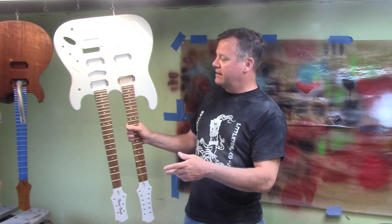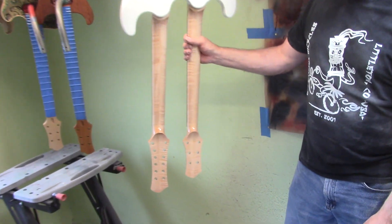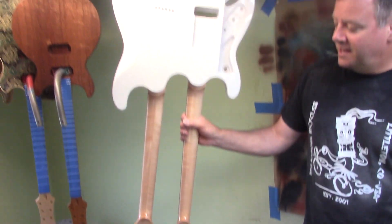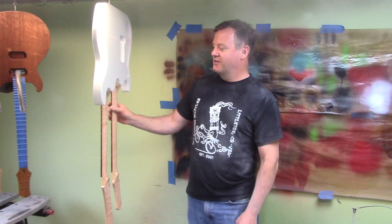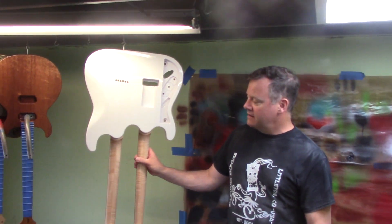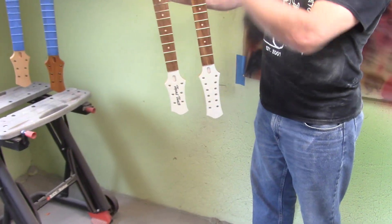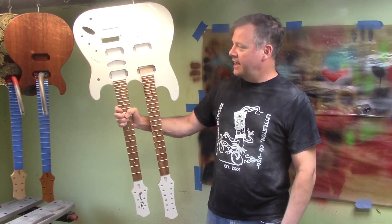Yesterday I came out, and after masking off the necks — because we left the necks natural, they've got all sorts of flame and they're super sexy. Jim said he really liked the necks and was glad that we didn't paint white over them. Masking the necks was a little difficult but it looks really good. Then I laid down the base of the white, did two coats of that — it's the whitest white we could find — then painted the headstocks, put the logo on, stripped off all the masking, and shot five coats of our Production Clear on it, and here we are.